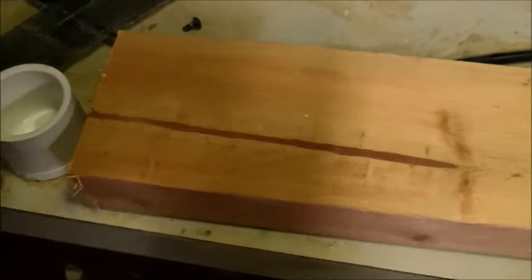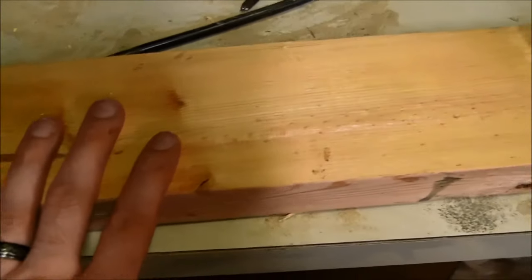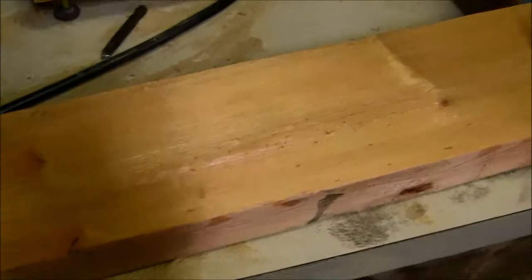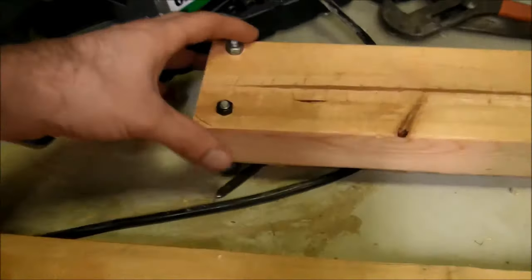The other side, we want to give enough room that it can hang off the edge a little bit here and have some support for if we've heated a little bit too far, so it's not going to get warped or out of position. We're going to put this other piece of wood on top of it that has these spacers so it doesn't flatten it so much at one end, but it's going to flatten it pretty much completely at the other end, and we're going to push down real hard, and it's going to make us a nice thin bow limb. Now that we've got the jig making and general tomfoolery out of the way, we can head right into making this bow.